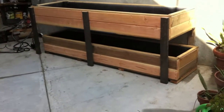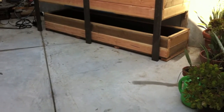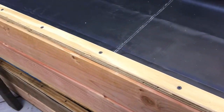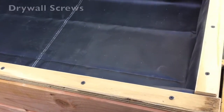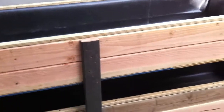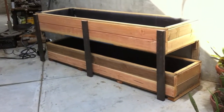The fish tank was the same kind of construction — 2x6s all the way around. I put some 2x4s on the bottom and beveled all the edges with a router just to give it a finished look. That top lip is strips of plywood — it doesn't crack out when it's plywood, which is nice. I screwed the entire thing together. The rubber is just laid in and tucked. Don't buy the liner at Home Depot because that stuff isn't good — I had to redo it once. This is a lot thicker and it's supposed to be the real deal, so we'll see.